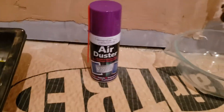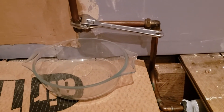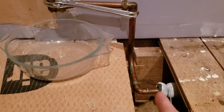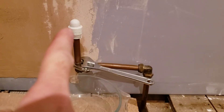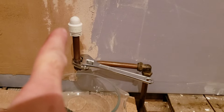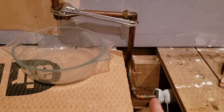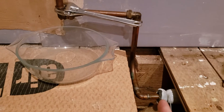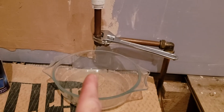This is my second go at this. I'm going to take off this bit of pipe, get rid of it. As you can see, that's where the radiator valve is there, so I'm just going to take this bit off, put an isolation valve where my fingers point in there, and have a straight bit of pipe running across - it'll come straight out the ground like that to the radiator.